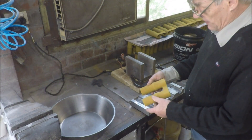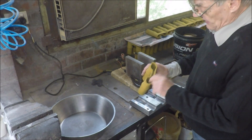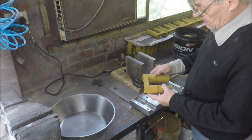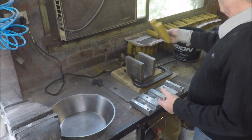It's an excellent sort of core because it's very strong, stores well, and won't draw the damp. It's hollow so it vents easily, and when the molten metal goes right around it, it destroys the binder in the sand so the breakdown of the core is very good.